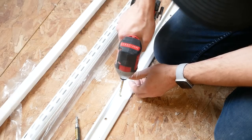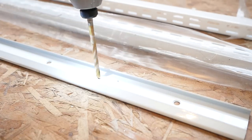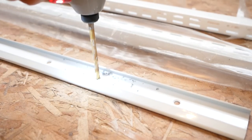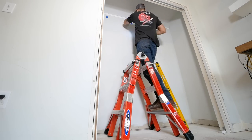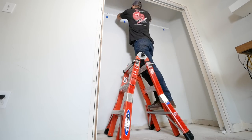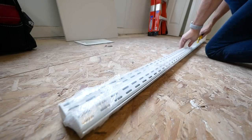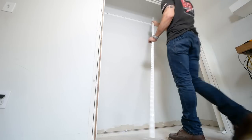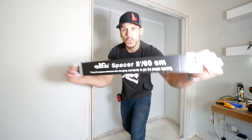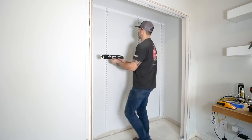The ones that don't line up to studs, you can use the drywall anchoring screws that come with the system. The option I decided to go with is to pre-drill my own existing holes, that way everything is set up and hooked up to the studs of the wall, having a far stronger foundation. Once the track is up, I can then insert the hangers through the inlet slot and slide them throughout the entire track. Then I'm using the included spacer template to space out the hangers exactly to accommodate all the drawers and shelves exactly how the designer created them.